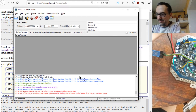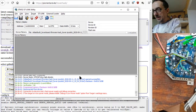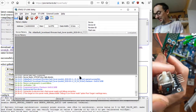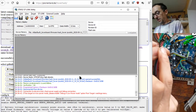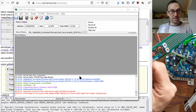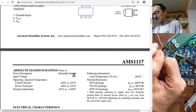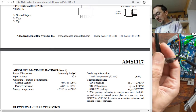We should now have joystick mode. I made another control panel. I take the 15V and use the 3.3V regulator — this is a bit risky since the regulator is only rated to 15V, but we have 14V so it's okay. Then simply two potentiometers connected — the easiest setup so you can use a long cable.